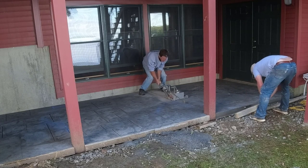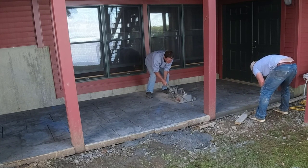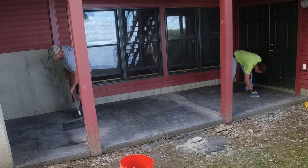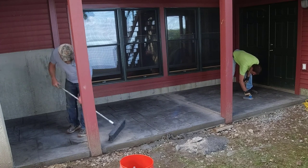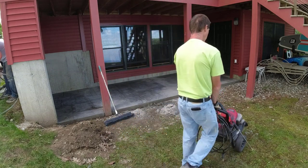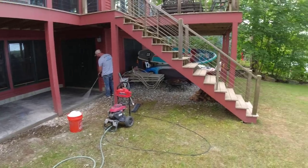Now if you're wondering why we're sawing this, it's just to help control shrinkage cracks. Concrete tends to want to crack on its own, so we're cutting a nice straight joint in there, trying to make it crack in that joint instead of somewhere random. We probably could have taken a chance on this small slab and not sawed it, but when you're doing work for a customer, you don't want to take that chance — you can't really make a crack disappear afterwards. Putting a couple of saw joints in there doesn't really show much, and it's just part of the deal with stamped concrete.